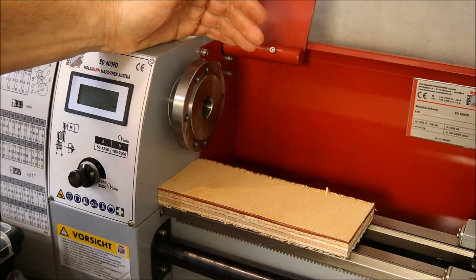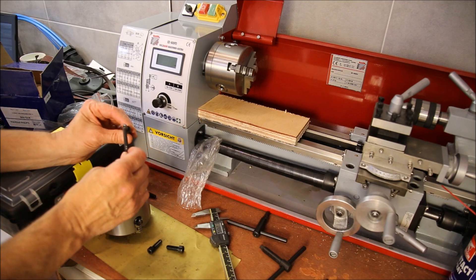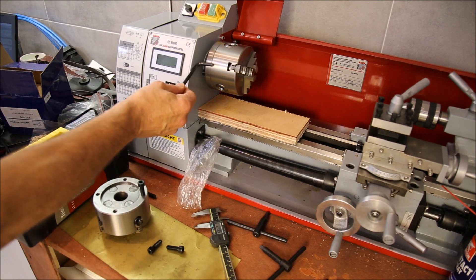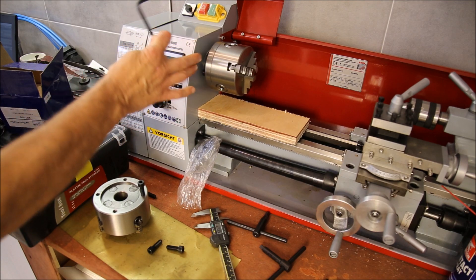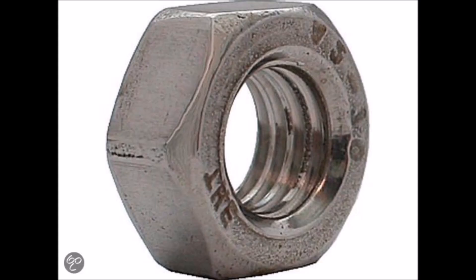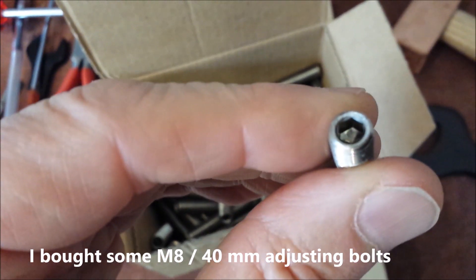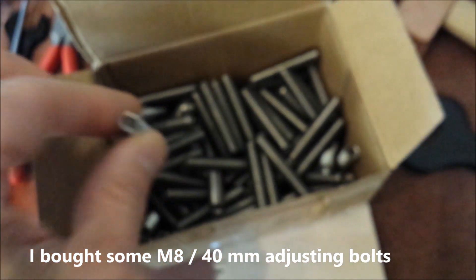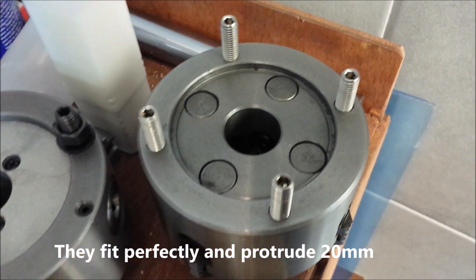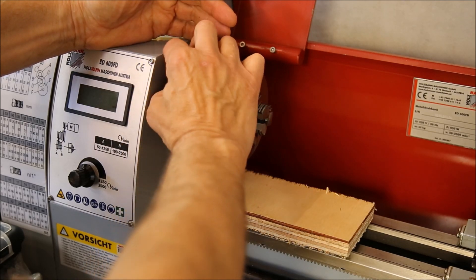So I have to get the right bolts. The chuck came with original hex screws, and I have the correct key for it. So this will work fine, but I cannot get in between the casing. We will use lock nuts because we cannot use the Allen hex wrench. The lathe has a bit of quality issues, but that's what you get for this price.